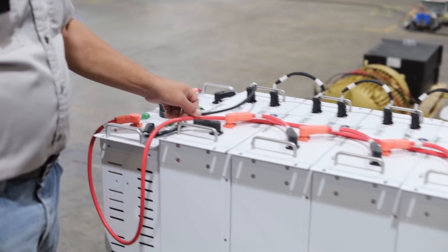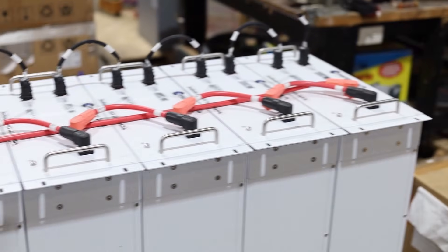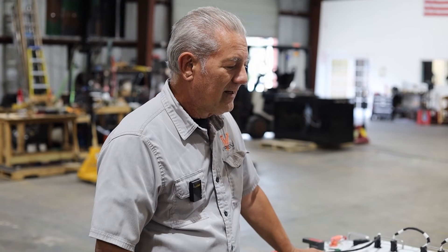And these, as you can see just by the cabling, you can tell these are run in series. You have basically a 500-volt battery stack here. These can be run up to 1000 volts in series and then paralleled out as much as you want for major battery energy storage systems. These batteries, from what I've experienced, have some of the best power balance I've ever seen. Straight out of the box, it checked out at two decimal points of voltage — within a hundredth of a volt — which really speaks well to the quality control on the batteries.